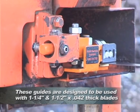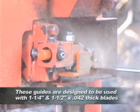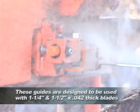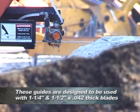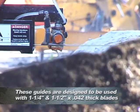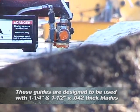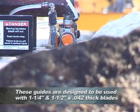The reason for the heat reduction is the elimination of friction that is caused when the flange actually scrapes the back of the blade, as opposed to rolling with the blade. Unlike the roller on a conventional guide that rolls with the top of the blade, the flange is traveling in the same direction as the roller, but not the same direction as the back of the blade.